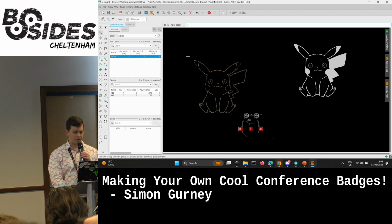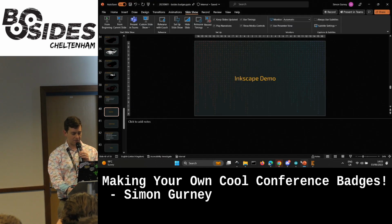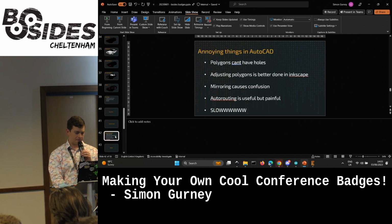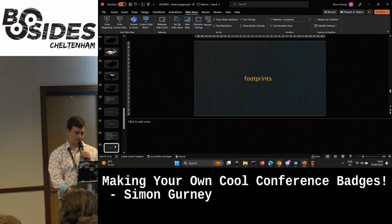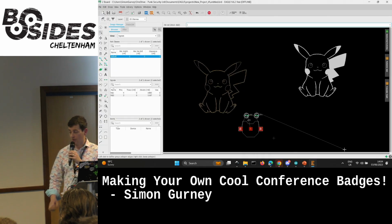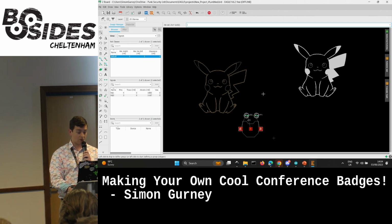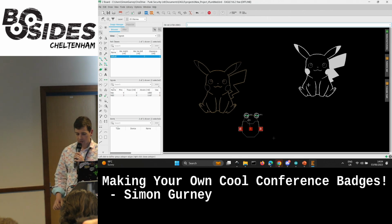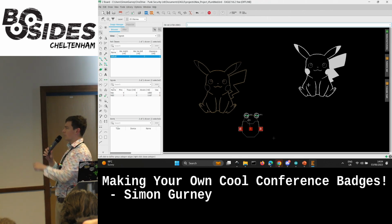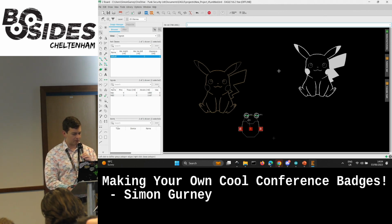So just to finish this off now, in fact, what did I say I was going to do in the PowerPoint? Inkscape, we went past that. Okay, so the last part now is just getting your board together. We've got two Pikachus and a load of components, so we just have to overlay those on top of each other. This one's on the names or values layer, because that's where we want the white printed to the board. And the other one is on the dimensions layer, which is perfect.